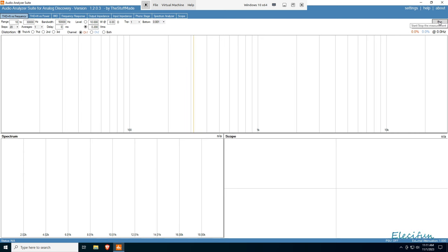But what I want to add to this as well is, I'm using 0, 30 volts, 5 amps. This is 300 VA. My ideal setup would be to have two of these, one for each channel, to ensure that when it needs it, it has that grunt. It's not going to need it all the time, but when it really does need that grunt, it can pull it from the transformer without pulling the voltage down. You pull the voltage down, you're not going to get the output.